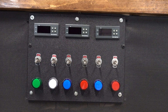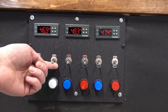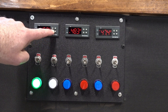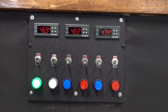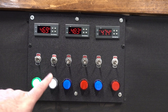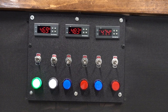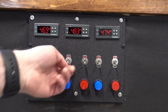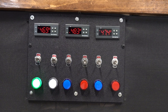Below the controllers are six switches. The first switch turns on the entire system — you can see the three controllers lighting up and a green indicator light letting me know the system is ready to go. The second switch controls the AC unit. When the temperature is set at 27 degrees and the glycol is currently at 46.9, after a minute the AC unit will turn on and a white indicator light will let me know the glycol is cooling. The third switch controls the glycol pump for my first fermenter — if the temperature gets too warm, the indicator light turns on to let me know cold glycol is being pumped through the heat exchanger.